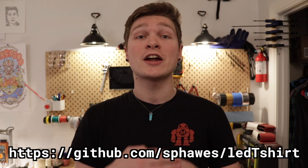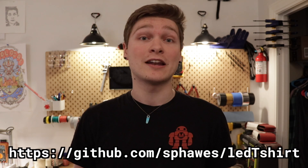Setting up the Raspberry Pi is a little bit more involved, but there's full instructions on how to do all the software for this project on the GitHub page. I connected my Raspberry Pi to my phone's wireless hotspot so I can go anywhere with the t-shirt and not worry about keeping a wifi connection. Connect your Raspberry Pi to your Arduino with whatever USB cable matches your Arduino. I used an Arduino Nano for mine, but you can use pretty much any Arduino you have laying around.